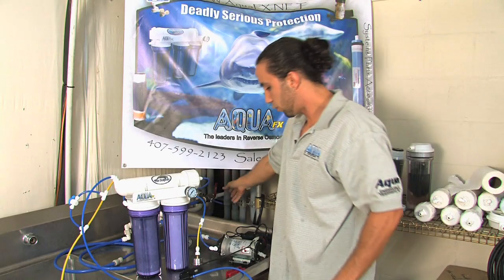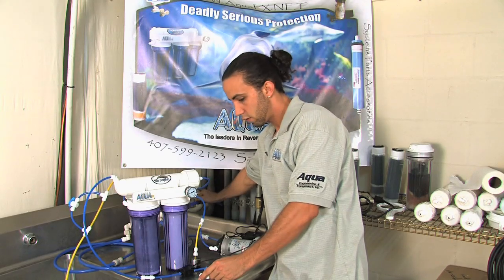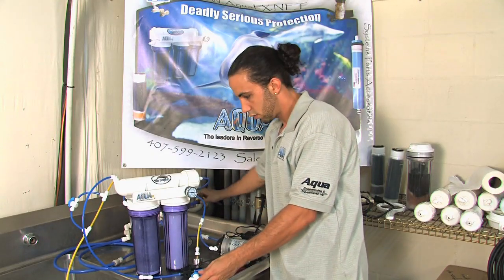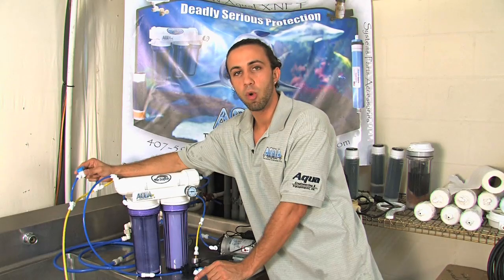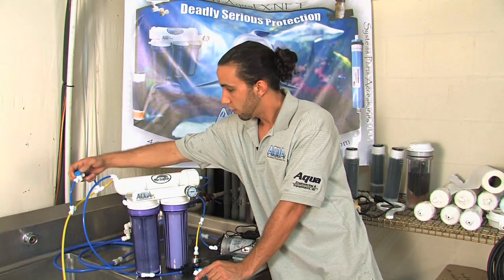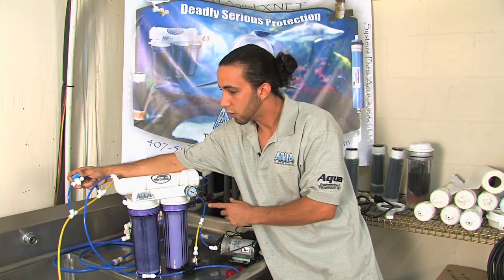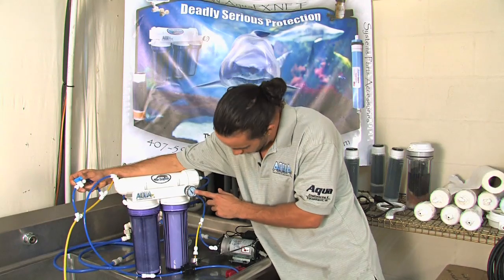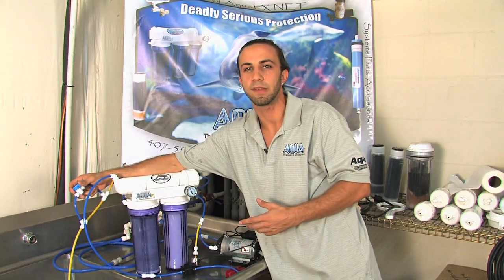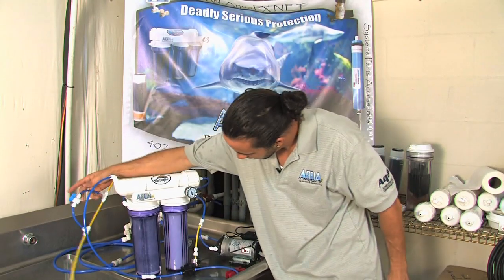I am now going to turn my unit back on again and resume production. I turn on the pressure and open up this line to turn the pump on. Notice I've made a common mistake — I've left the ball valve on the flush kit open, meaning that all the water and pressure is going down the drain. When I start to close this, I'm going to yield some pressure back on my gauge. I'm now restricting this ball valve on the flush kit until my gauge shows something about 80 PSI. We can be a little bit below 80 PSI — that's okay — but we don't want to exceed 80 PSI as it may be unsafe to run in your home. So I'm now running at 75 PSI, nice and healthy.